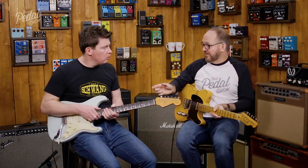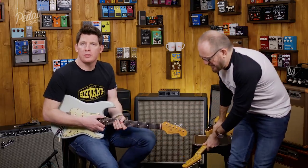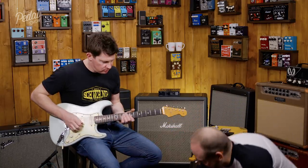If we turn the buffer on, the output impedance of the wah will go down. And that's going to drive the input impedance of the fuzz. Now, normally, we say don't use buffers in front of fuzzes because they want to see the inductance of the coils. They want to see all the stuff going on here. This is the one situation where a buffer before the fuzz can help. I'm just hoping that it's going to sound better. So I'm going to turn the buffer on.